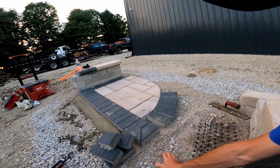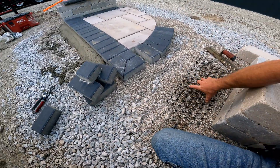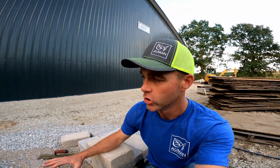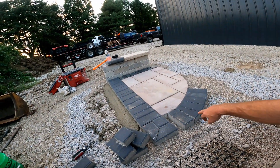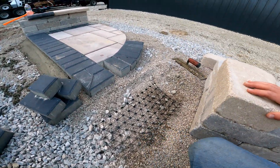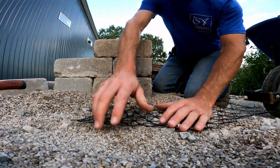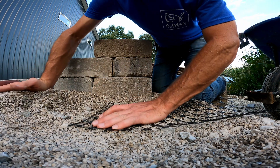If you imagine this edging and these pavers continuing on down through here - before we screed out our paver base, with the number 57 stone all through here - we're going to lay down this geogrid to whatever prescribed depth we feel it needs to be. This is not engineered; it's a system that works for us. We're going to take this geogrid and run it about 18 inches back into the paver main field, right before we lay pavers and before we screed out our bed of number nine. Then we screed the number nine over the geogrid, one inch deep, just like we normally would.